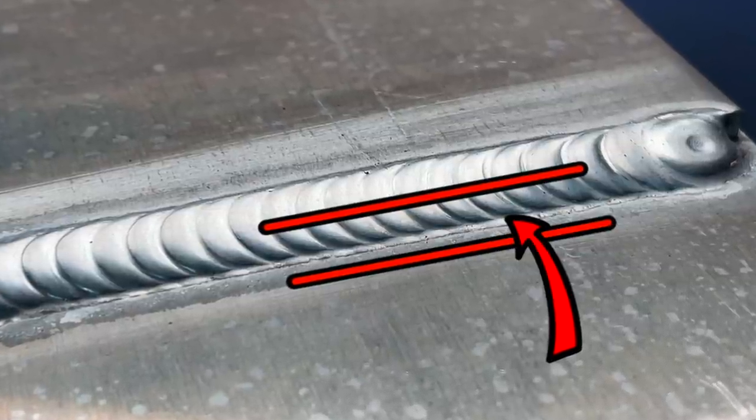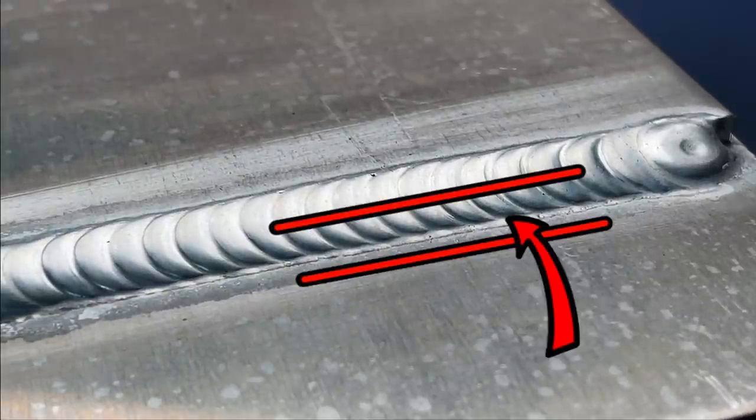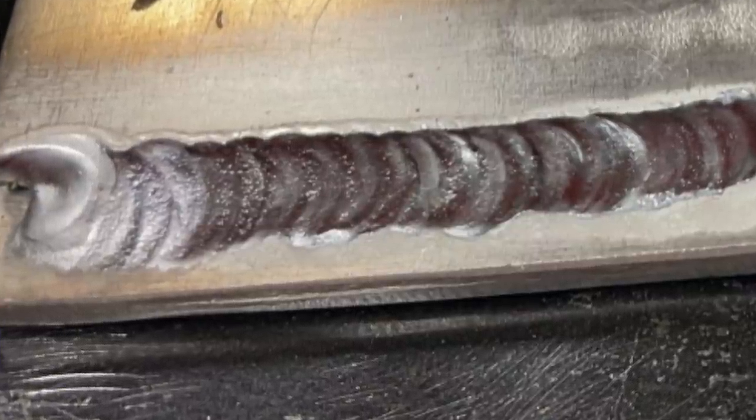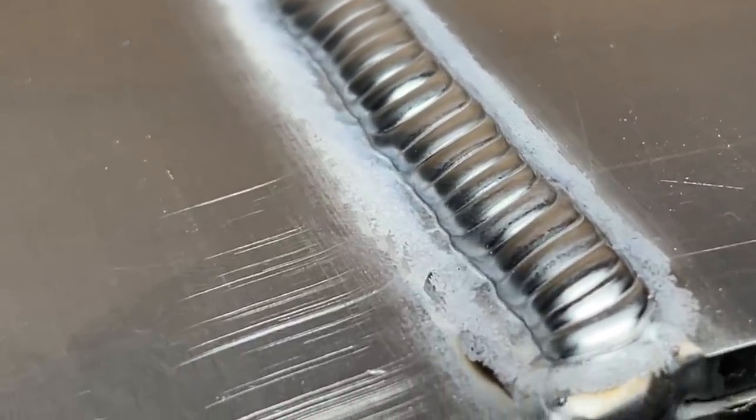The second thing we can take a look at with your own work is your edges. Looking at your edges, especially on joints such as a lap weld or a butt weld — these are notoriously tricky joints to get the edges to blend in properly. Scrutinizing how these went, whether good or bad, will tell you a lot about how you did with your starts as well as the details once you began moving. The blended edge where your filler material fuses with the base material can tell you a lot about what is happening through the length of your weld. Perhaps the blending was even too smooth — in that case we would have a concave pass, which indicates excessive heat input. Perhaps the blended line was much too rigid and didn't have a smooth transition, which would indicate that things were not hot enough to allow proper blending between the two materials.